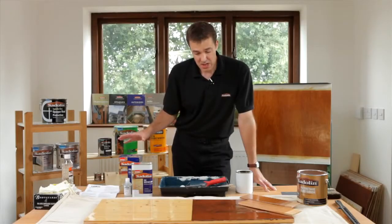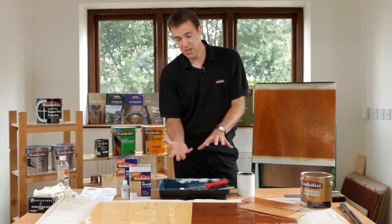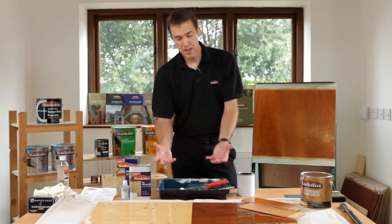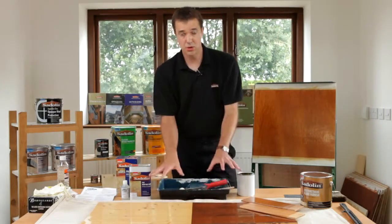The other thing you need to make sure is that when this product is drying and curing there is airflow. Lots of people just open windows and expect that to be sufficient, but we need airflow because as the solvents come out of this system — and you're obviously working on a horizontal floor — they need to be blown away from the surface to allow the finished article to dry off, cure through, and harden.